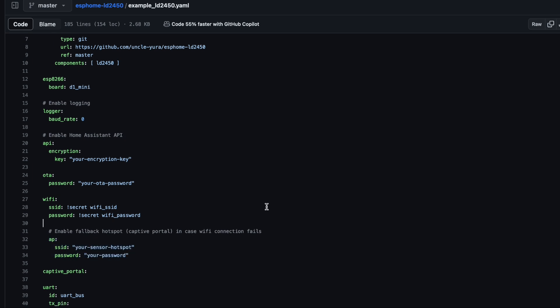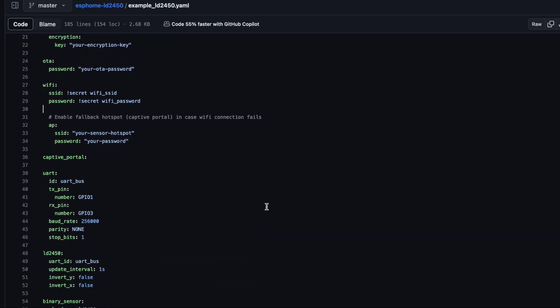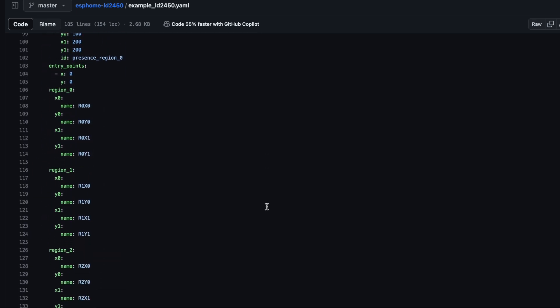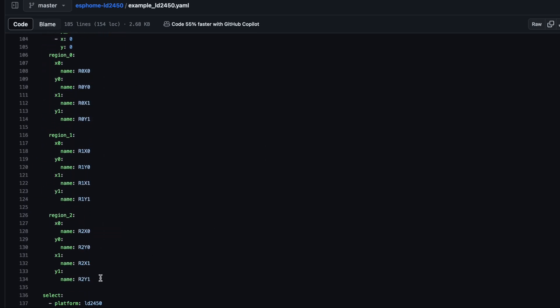When the device is already installed in your place, you need to add the zones and the points of entry. The device has to be assigned to the zone. You can define three zones of detection or three zones of ignore. This is very useful when you need to reduce the radius of operation or turn off the detection of movement — for example, where there is a ventilator.